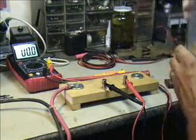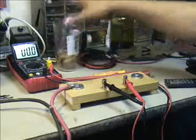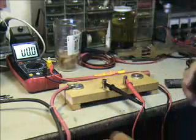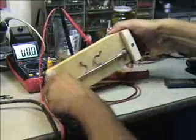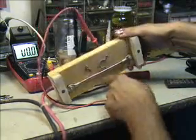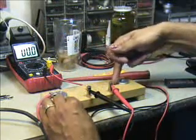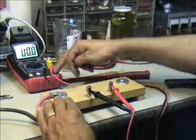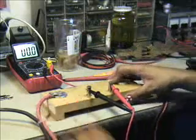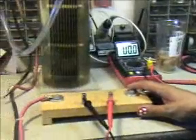Here we are back again. We are going to hook some power to this. We've got our little shunt bar, whatever you want to call that, wired in. Now we're simply going to run our positive through that bar and onto the cell, and tap off in millivolts to the meter to read the amps on this. Let's go ahead and hook our power up into this.